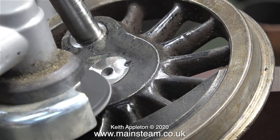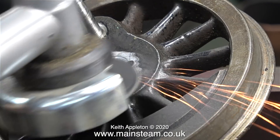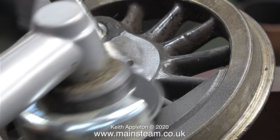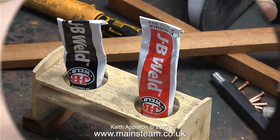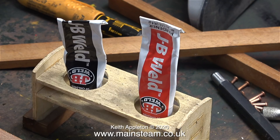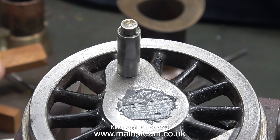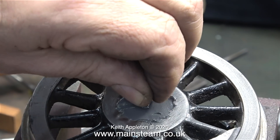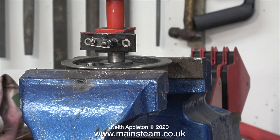It's time to clean up the other wheel sets. Here I'm grinding away the centre of the axle, which is meant to protrude, but unfortunately someone has drilled random holes all over these things to hold the axle in place into the wheel. My Proxxon Mini Angle Grinder fitted with the usual flapper wheel makes short work of the axle. After giving the front of the wheel a rub down with some 100 grit emery cloth it's time to use some JB Weld to fill it. JB Weld is a two-pack epoxy resin mix — this is 24-hour JB Weld and it dries very hard and very strong.